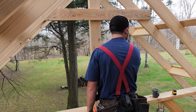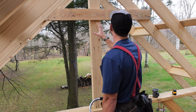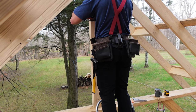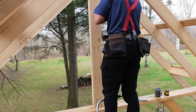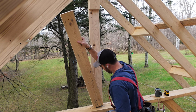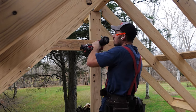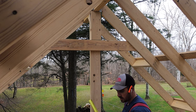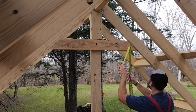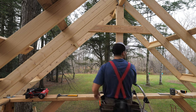That guy is the same width as my header, but I'm going to take this column out, so I need something to brace it before I do that. This piece is now going to go in the opening — 46 and 3/8. The reason I only put one nail in there is so I can pivot it into position — that's right at 46. We had to switch over to the big camera. Got my header in there.